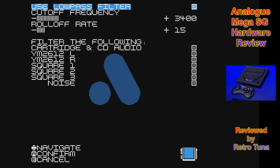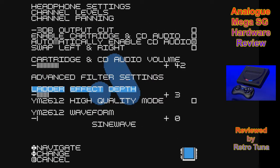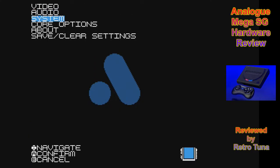What I would say, out of the box, this machine has really clean, fine, really high clarity sound. Unfortunately, it is a bit on the bright or very high pitch side at certain times in certain games. We'll probably do that in a little bit. You do need to adjust it, and the low pass filter does make quite a bit of a difference. The larger effect is at the end of the Mega Drive sound, when you get a sound effect and it sort of decays off. You can adjust and put the decay back in, and then you can mess around with the sine wave and the waveform, which I haven't done.